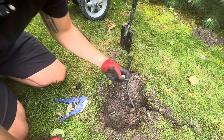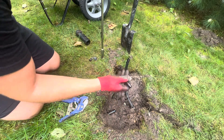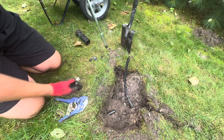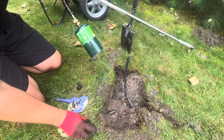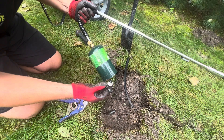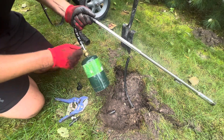Here's a little pro tip: this line can sometimes be hard to work with and hard to snug onto these fittings. So what I'm going to do is use a torch and heat this up just a little bit so it just slides on with no issues and no leaking water in the ground. You can get the same exact torch in the description below.